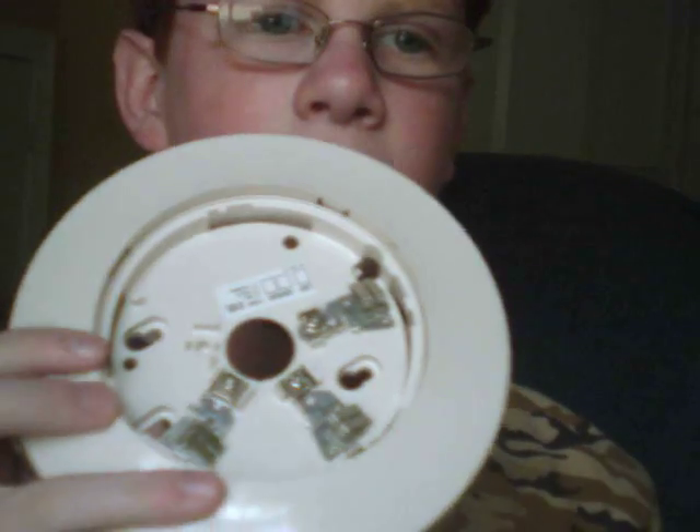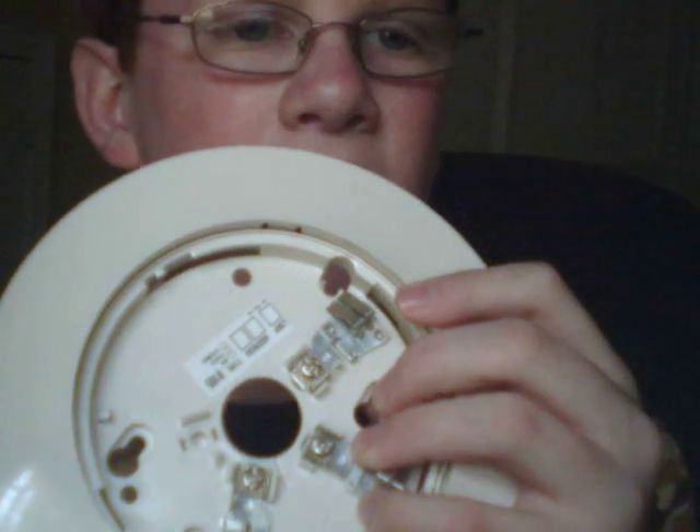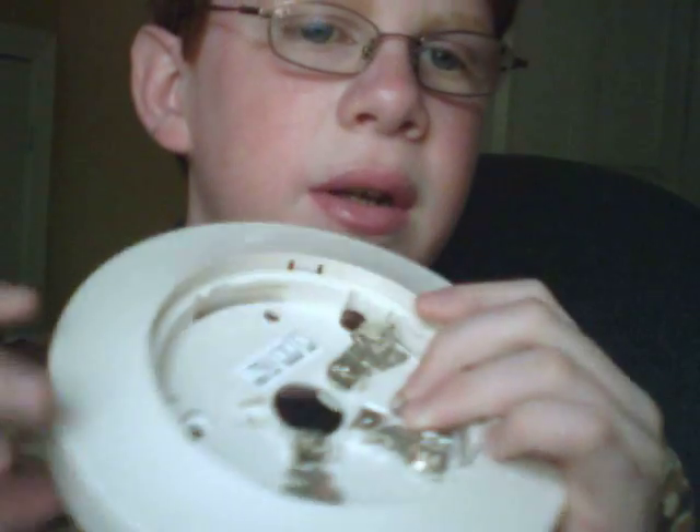When we're done, we mount and write down the address and the loop. When the address is set on this head — the head contains the address — we're going to twist the head in and snap it in. And that's how you wire the base up.